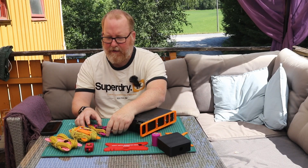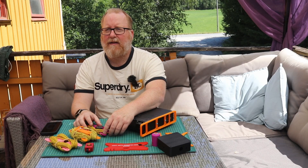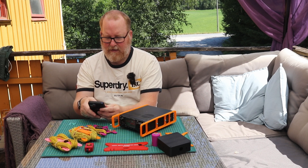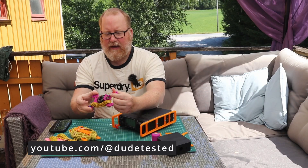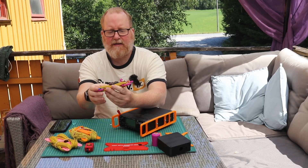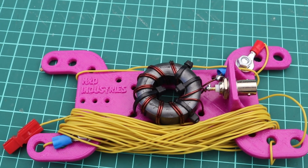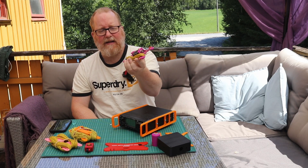Then there are more antenna winders here. All three of these come from my good friend Ham Radio Dude — I think he rebranded his channel as Dude Tested; I'll put the correct name up on screen. He designed these winders for sale with his own antennas, but they're also freely available on Thingiverse. This one has a BNC connector and is a 4-to-1 with 7.6 meters of wire and a counterpoise connection with a pair of power poles — it's the world-famous Rybakov antenna, one of my favorite verticals. It's a random wire vertical that works every time, tunes pretty much any band, and is a good performer.